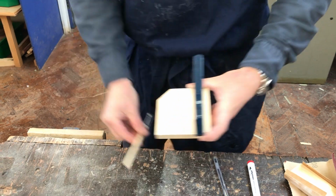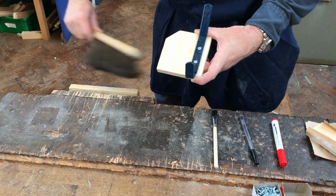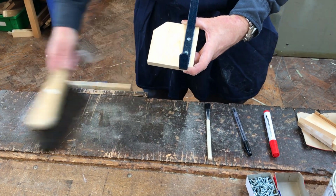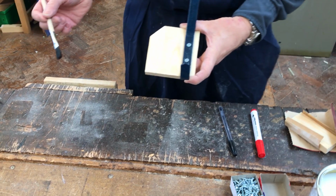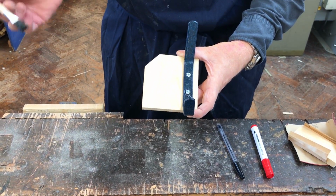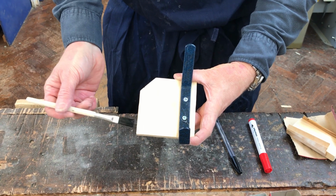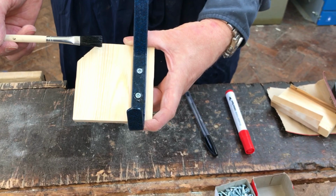Now, you've probably been sanding, so if you have been sanding, take a brush and just simply sweep all the dust away because we want it to have a nice clean environment when we're actually varnishing. Now, on each table, Mr. O'Donnell's probably put a pot with some varnish in it. So here's the brush you use, and you can see the grain of the wood going up like this.